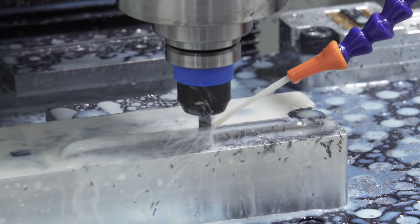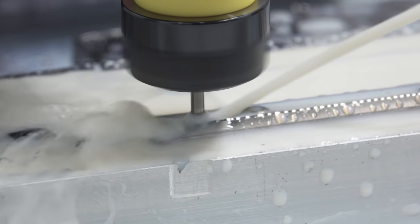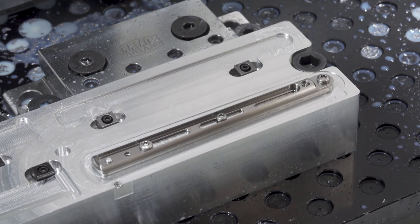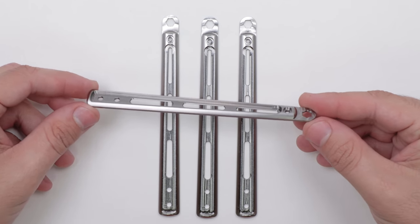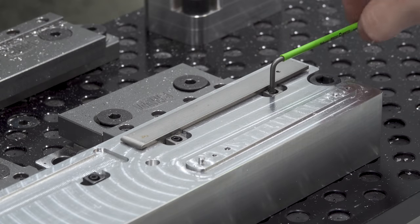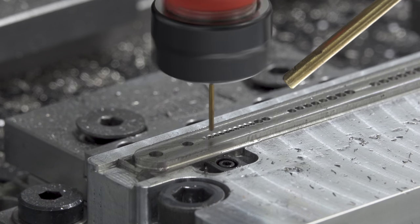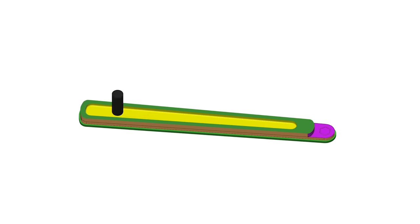Op 3 — I finish the outside and do the usual surfacing and deburring. I think this looks really good. I made more without the chamfer mistake. So, what have I learned? I learned I can hold a very small amount of material with the smallest pitbulls with no issues. I tried a different way of fixturing the handles, which works, but I think I should still probably try to make the handles in two operations, even if it uses more material.